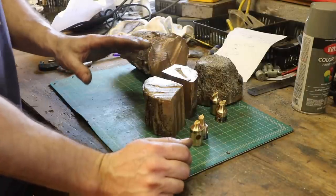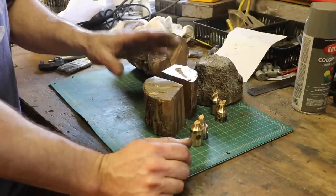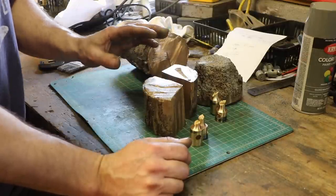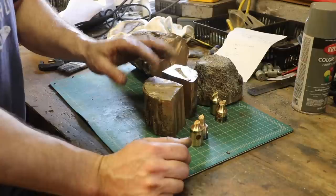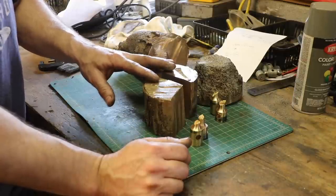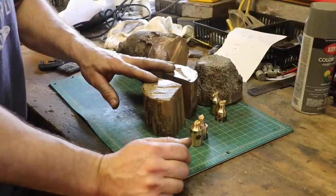What I think I'm going to do is I'm going to go back to what I know with the mold. I'm going to make a wooden split pattern, and I'm going to mold this thing with a regular green sand pour. I'll ram it really tight, and I think I'll do just fine like that. Then I'm going to drill out the cannon. I'm probably going to keep the bore smaller, just for safety. I'll drill it out at like probably a 3/4 inch bore. I'll shoot it, and I'll have some fun with it.